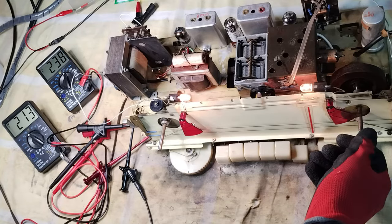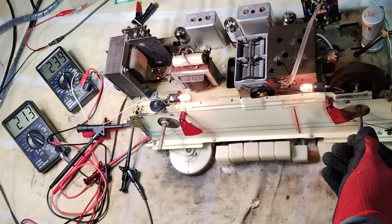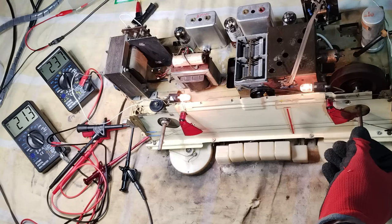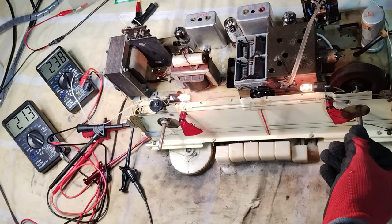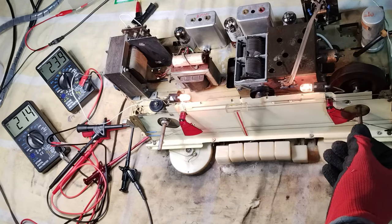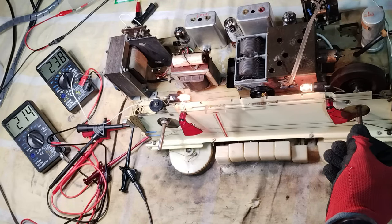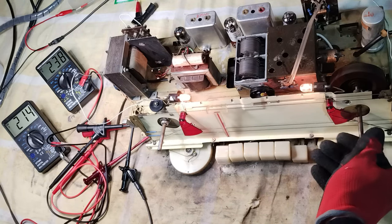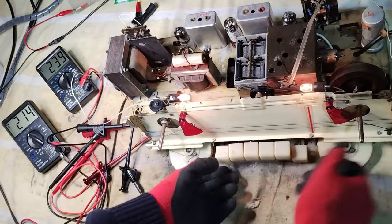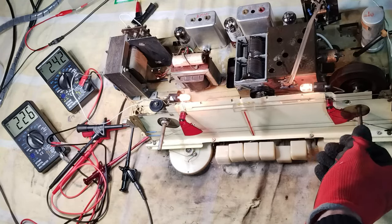After cleaning the chassis, observing that the components were still in good visual shape, a test was made using an isolation transformer and dim bulb tester. However, for precaution, the final amplifier tube was removed and the audio signal was collected from the volume potentiometer, listening to it from a signal tracer. The radio was working, but in the AM bands the variable capacitor was shorting.